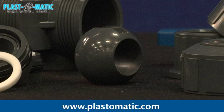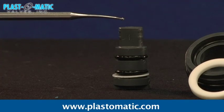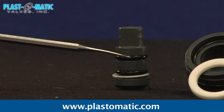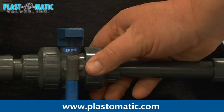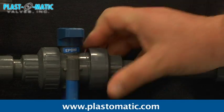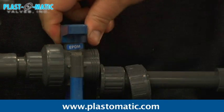A fully concentric and mirror polished ball assures smooth leak-proof operation. A large diameter shaft eliminates the possibility of breakage. Dual shaft seals eliminate stem leaks. PTFE bearing eliminates shaft wear. The top and bottom trunnion design permits flow and pressure in either direction and eliminates the stresses inherent to a ball secured only at the top. The trunnion design permits downstream piping disconnect and multi-direction flow.